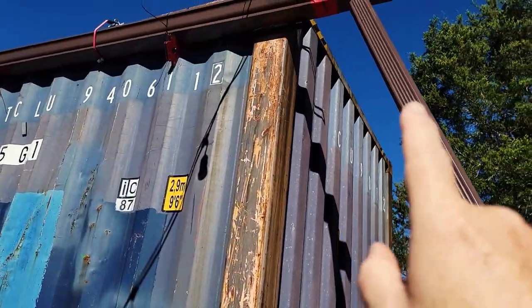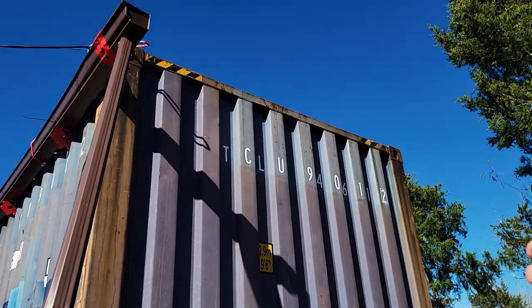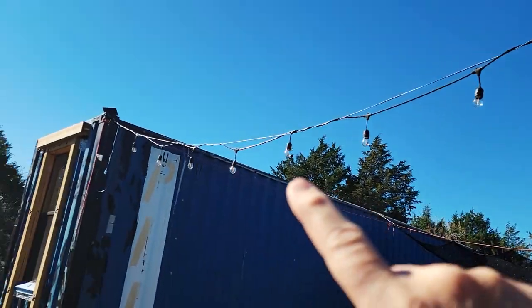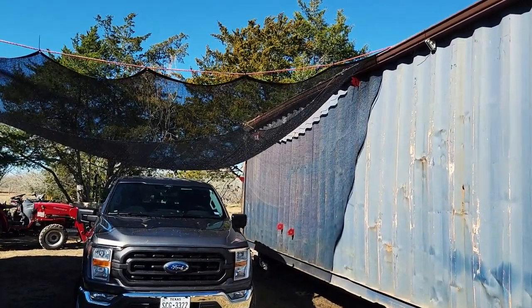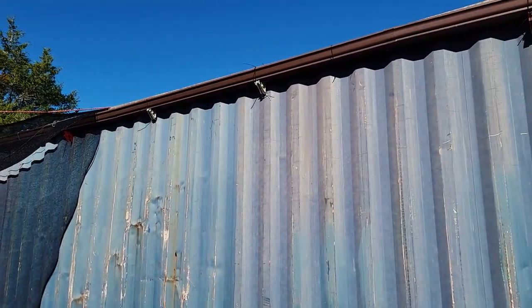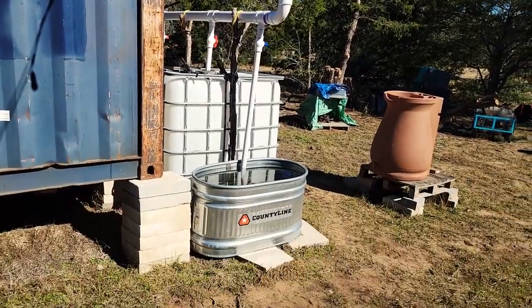Once that's full, I top off. You'll notice that my shipping containers have a slight lean, and I did that on purpose. These are rounded, so they tend to shed water on both sides, but I tip mine so they run towards the gutter. This gutter gives me about 200 gallons of water per inch of rain, and it is up with duct tape and magnets — and it has been up the full time. It has been one of the worst droughts in history in Texas. Tip number two: don't be afraid to put up a temporary gutter like I did with magnets and duct tape. That's held in Texas sun all summer long — a great tip to get water out here.